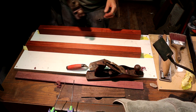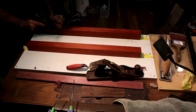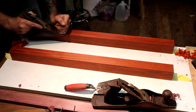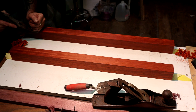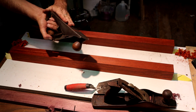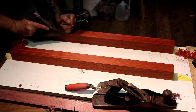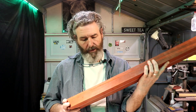All right, we're nice and solid. Let's take a couple of passes on this thing with the plane. And if you'll notice, as I move over this way towards this side of the board, I angle my plane like that so the sole of the plane is riding on the board and getting me a nice flat surface. What I want to do now is get this thing glued up. I want to get some veneer put in between here.